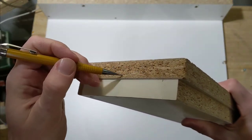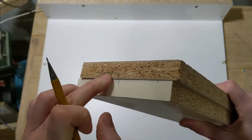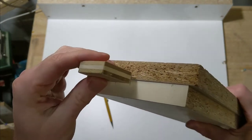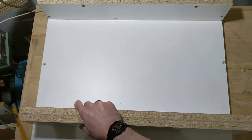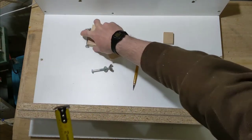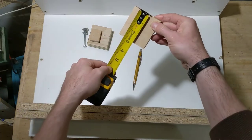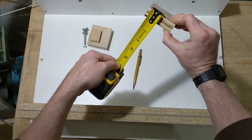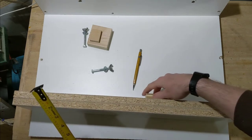I'm gonna cut a slot in the front fence by running it over the table saw over and over, slowly moving over to cut the slit out. That slot will allow the stop block to slide in there. The stop block is assembled from two pieces of scrap the same size — one for each side — about two and three-quarters inches tall, two and five-eighths wide, and almost exactly an inch thick.